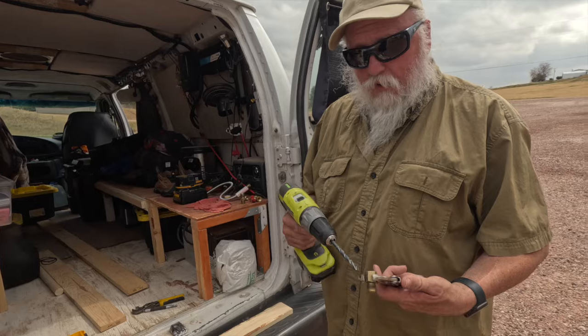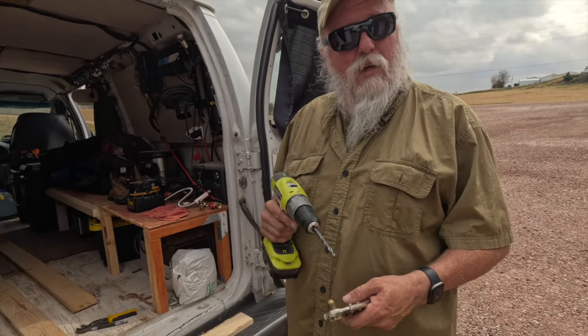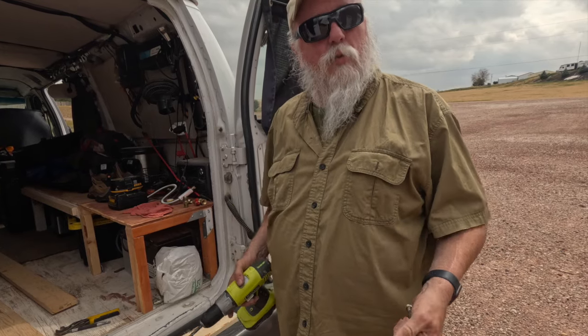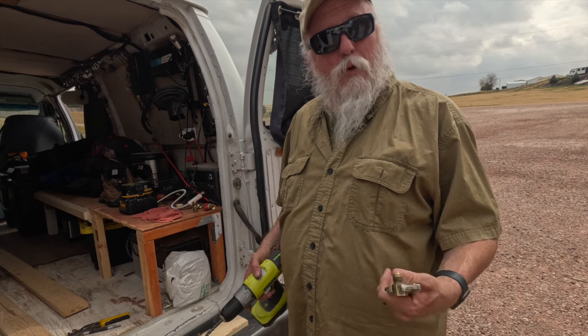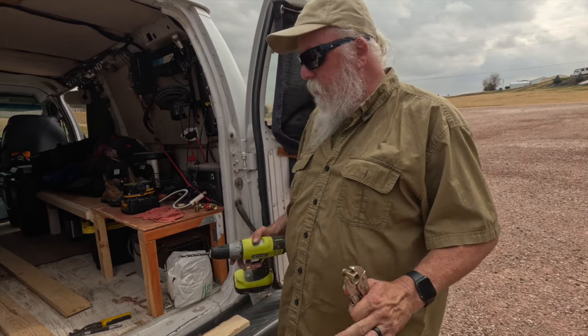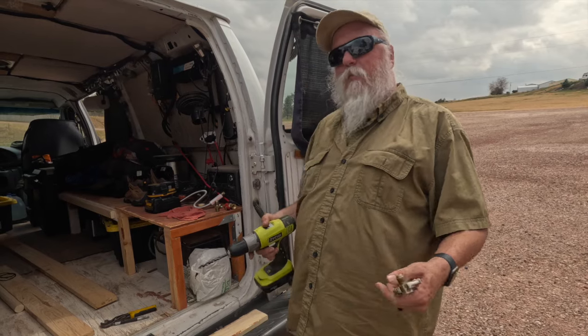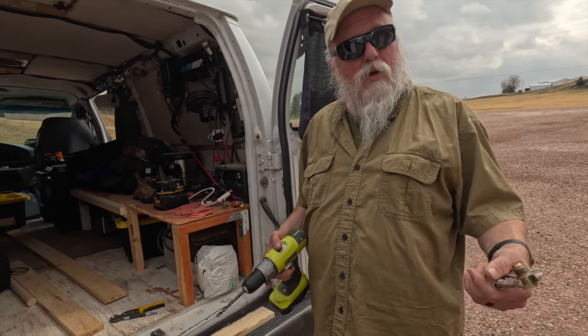I mean, I can drill it out, it's just brass, but I don't know if it's gonna seal up right. So we'll test that carefully, both with a combustible gas detector that we have, as well as with the old-fashioned soapy water bubble spray thing, and we'll make sure that it seals up tight if I can get it to fit. So we're kind of improvising here, from some real old tech, trying to get it to modern.